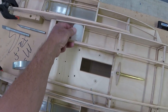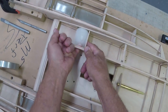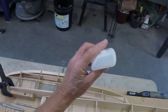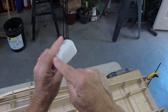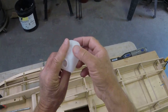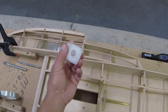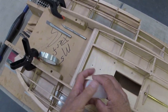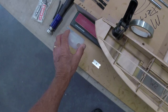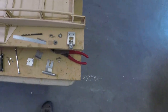Reason for all of this is if I mount this guy at a nice sharp angle, we talked about this in an early video. If I mount this guy at an angle like this, and this is tough, man, but if you bend the tubing around where you're picking up from this bottom corner, man, you can suck every last drip of fuel out of this thing. So if you're like me and you get two penalty laps, you can still finish the race. So that worked out well. I was pleased. Let's mount some stuff.